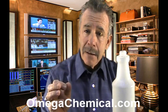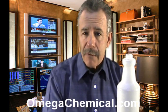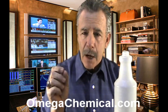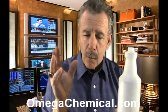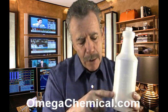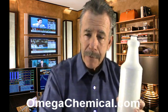You either have to time it and know exactly when one minute is up and know what your machine is putting out, or you have to measure what's coming out in a five-gallon pail. Either way, you have to know when that machine has pumped out one gallon of product, then shut everything off. So you've pumped out either one gallon or four gallons of product, whatever your machine is set to do. Then you look and see how much has been drawn out as the four gallons in one minute has been pumped into your pail.